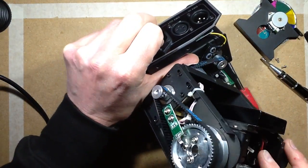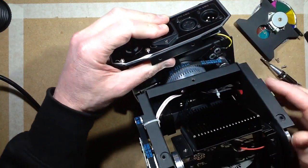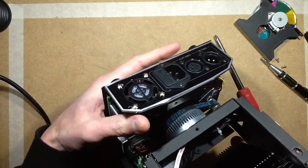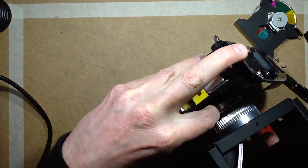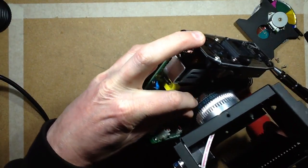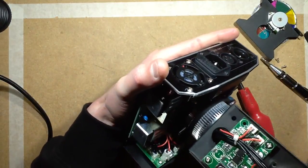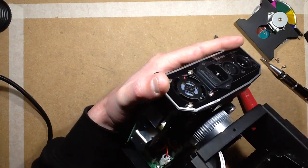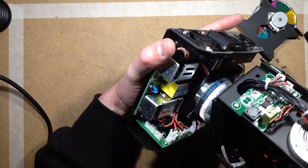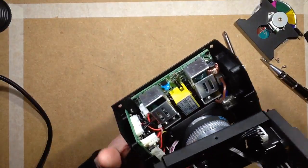Again, it's got the drive belt, it's got the slipping actuator here that actuates that switch there, the little switch down here that gives it its home position. And that actuator also slides round within a sort of margin underneath the yoke itself, so that it's got more than 360-degree rotation. When it spins round the opposite direction, it spins almost a whole revolution before catching that.